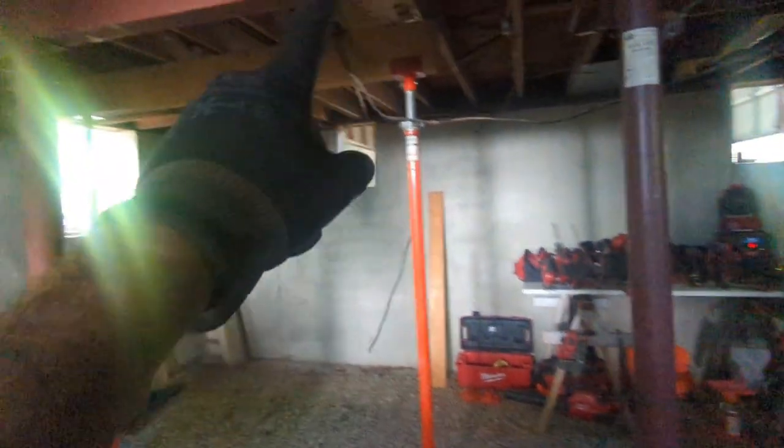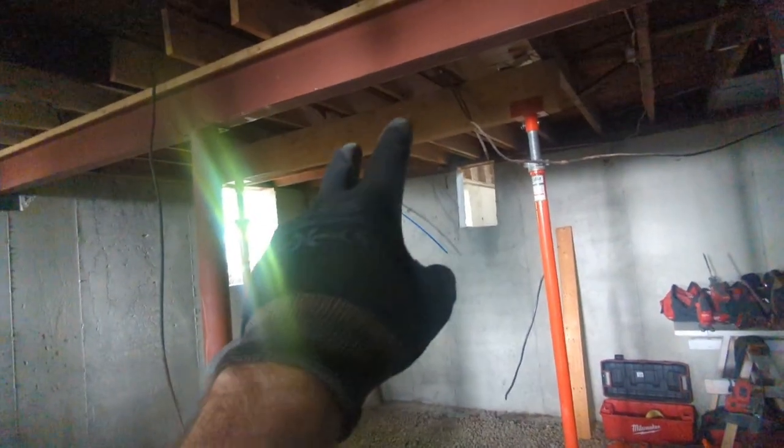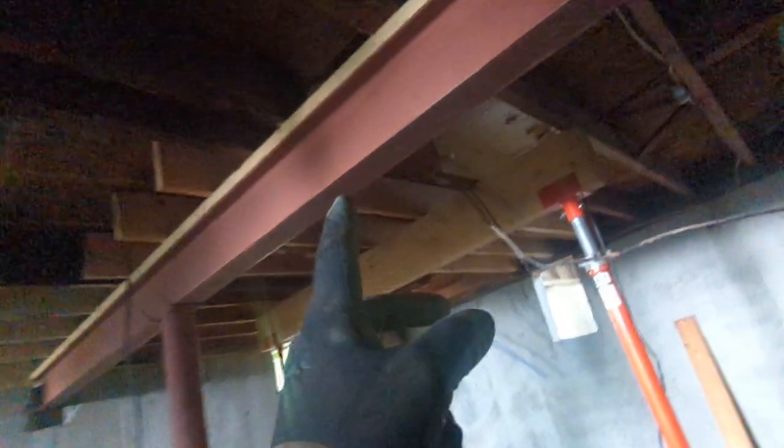And if I'm going to do that, I'm compromising this area, even if it's just a little bit. And if I'm compromising this area, I'd really like to have this system underneath it. And in order to have this system underneath it, I need to be done over there. And to be done over there, I got to put that last sister joist on. And to put that last sister joist on, I need to cut this out of the way because the end of it's interrupting over there. And to cut this out of the way, I want to put that system, this temporary load-bearing system, over here. And around we go.